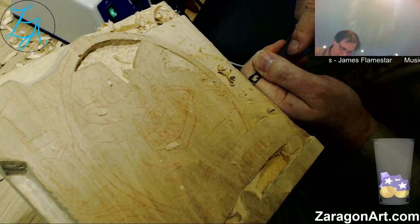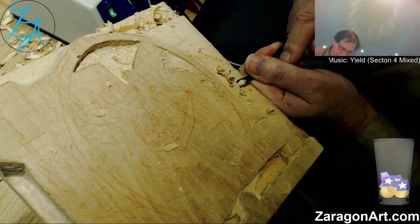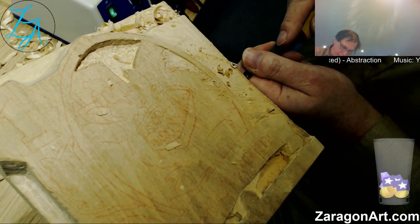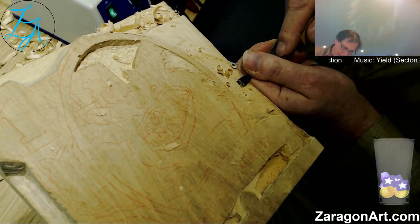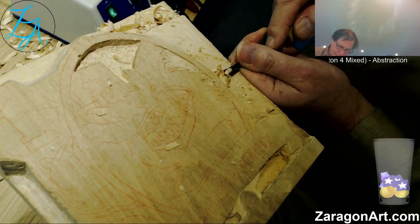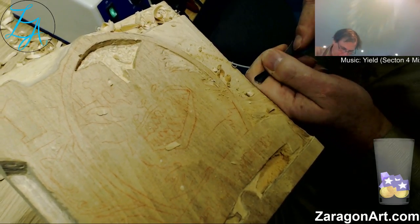If you really need to carve on a piece of wood using a gouge, if you can keep the top edges above the surface of the wood, then you stand a better chance of being able to carve on successfully. Carving on with a flat chisel is quite difficult.